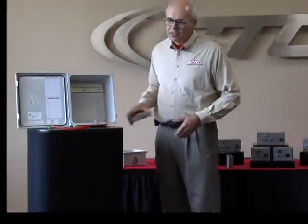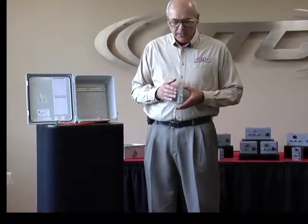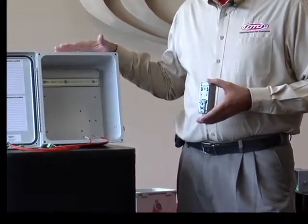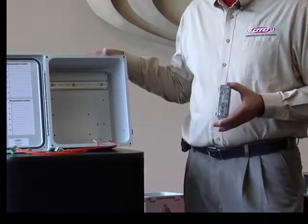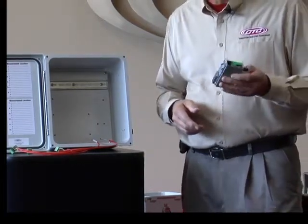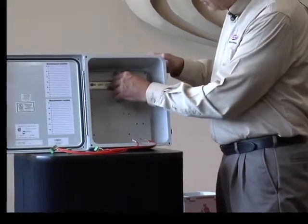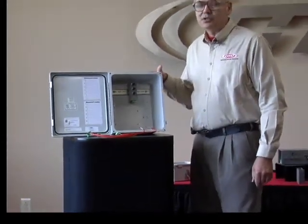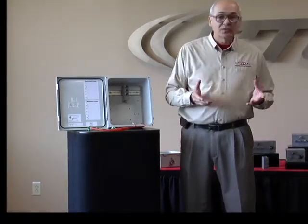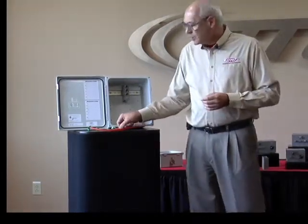And this modular system incorporates what's known as a standard DIN rail mounting clip. And this mounting clip can be put into a box that you purchase from CTC, a box you purchase in your region, or even an existing box you already have on your machine. And it's quite easy to just use the plug-and-play technology we've built into our module switch units. You simply come in, clamp on a DIN rail, and snap them in place. And you're good to go. So this is going to give you a lot of freedom to design and incorporate these switch modules in your system or applications. I mentioned earlier that we don't like to have any dead ends.